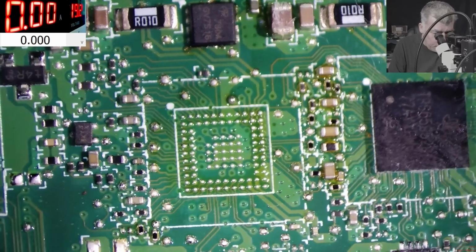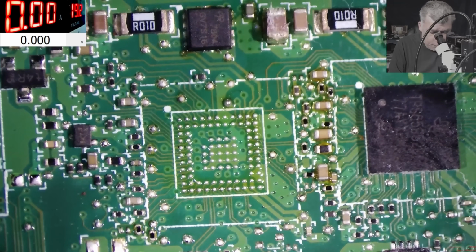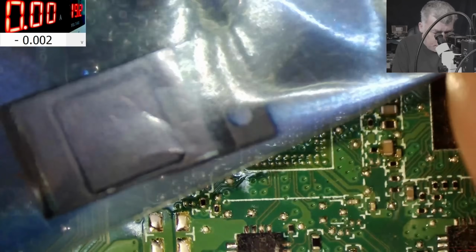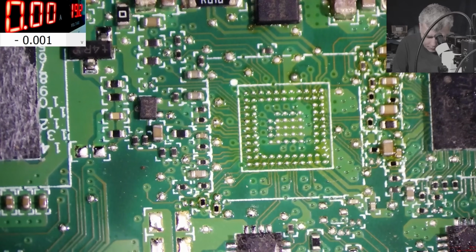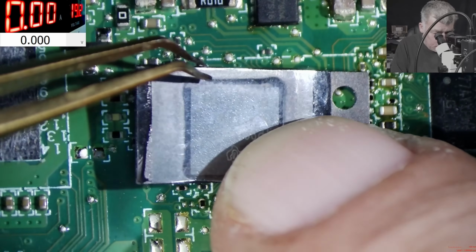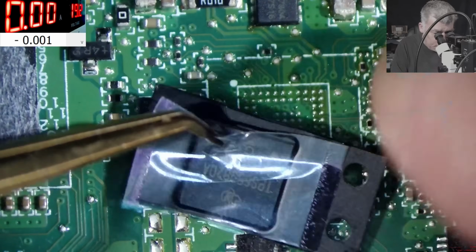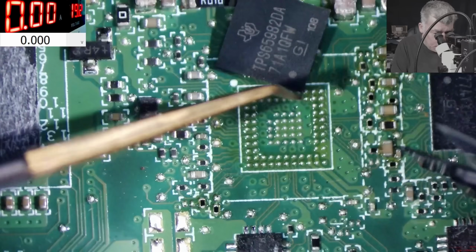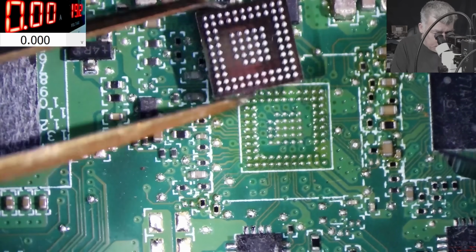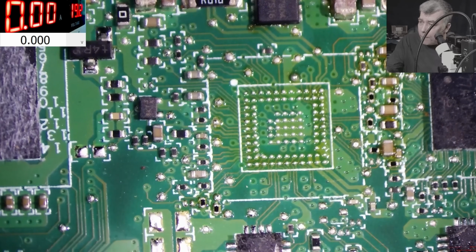I mean, hopefully it will work. The solder balls are fine, but I don't think I want those solder balls there. Now let's open the new chip and see if it has solder balls. Probably it has. Okay, so that's the chip. Let's take the chip out. It has solder balls, yes, so I'm not comfortable soldering over those solder balls. So let's take the solder balls out quickly.